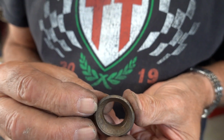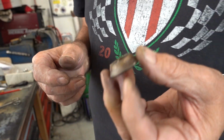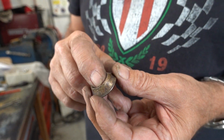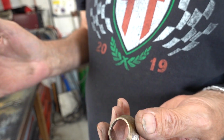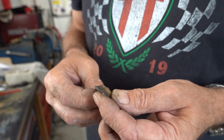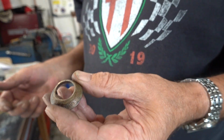Well, that's pressing a bit better. What I did, and I think I forgot to do right at the beginning, was when I punched the hole, I didn't anneal the coin. In fact, I suppose I should anneal it before I started, because I don't know how hard that coin is. So I've annealed it. I pressed it a bit. I annealed it again, and I'm going to anneal it again.